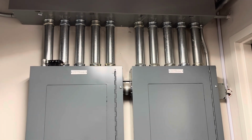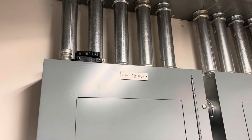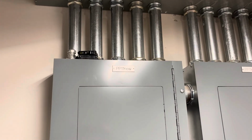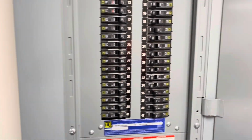The electricians that do a lot of the new construction here at the school do a good job at labeling the circuit and panel number. So on the service switch for the condensate return pump that we're changing, they have it labeled panel 11, circuit 32. I've already been here. I made sure that that jives with what's shown in the panel.